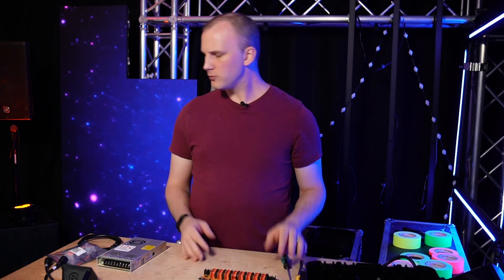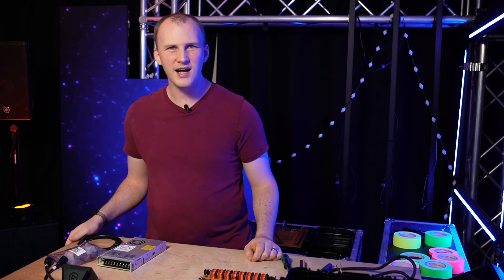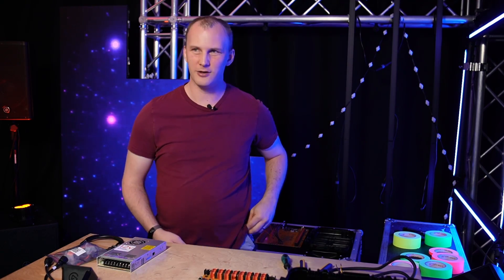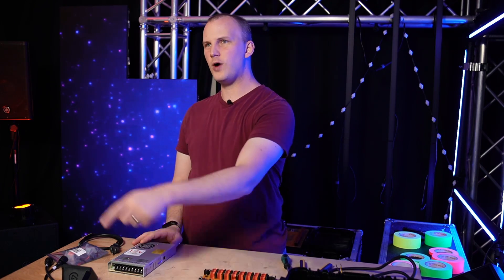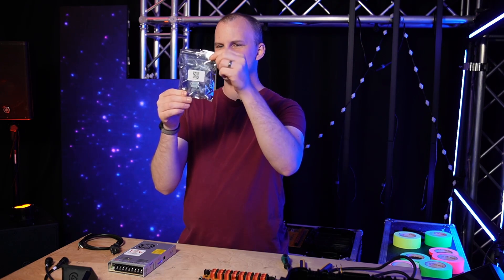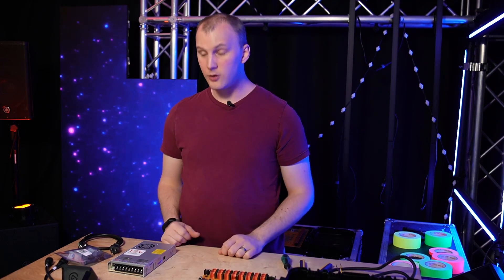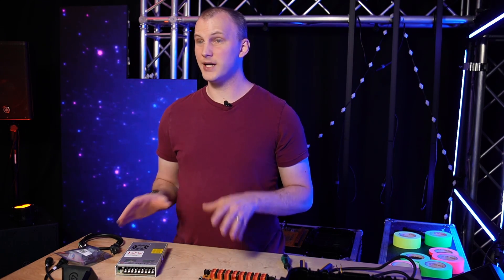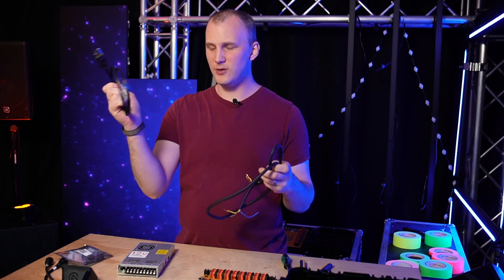So we're going to do the socket box style. This is a generic brand socket box I got in the height of the season when real socket boxes were out of stock. They don't really cost much less, and the real brand name socket box ones are significantly better in my experience, so I recommend going with the name brand. We've got a 12-volt Mean Well power supply, our controller, some wires, and these little standoffs that come with the Genius controller. Let's dive in. First thing, we're going to go ahead and start hooking up wires. I'm going to hook up power first to the control board and power to the mains on the Mean Well power supply.